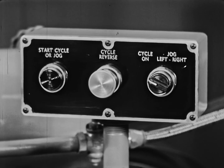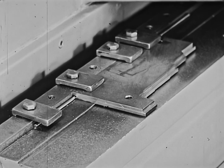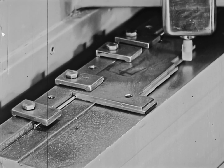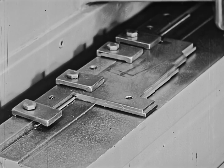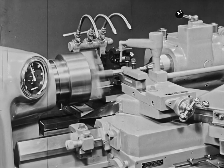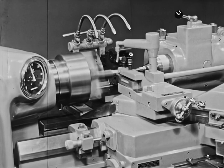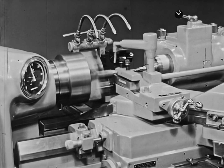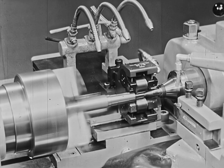The simple operator controls are mounted on the carriage. The air gauge tracer dual template control system is one of the features transforming this rugged high-speed lathe into a production automatic. Rough and finished turning is accomplished in one continuous operation, with duplication easily within plus or minus 1/1000. Rear slides are often tooled for cutting, but here a thread-rolling attachment is used.